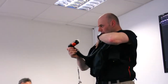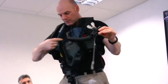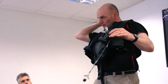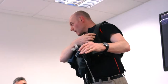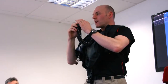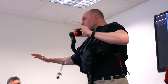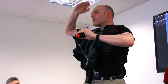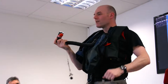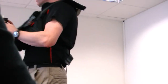What you'll see is the bag will start to inflate around you. The breathing bladder you're breathing from is not just here — it starts here, goes all the way up the side of the jacket, around the back of your head, and down the other side. It's horseshoe shaped with a big volume in it. Now you're breathing your own air. Once you've done that, hand is back to buckle. Your other hand's on your exit. When the water level comes up to eye level and above, you start to count.